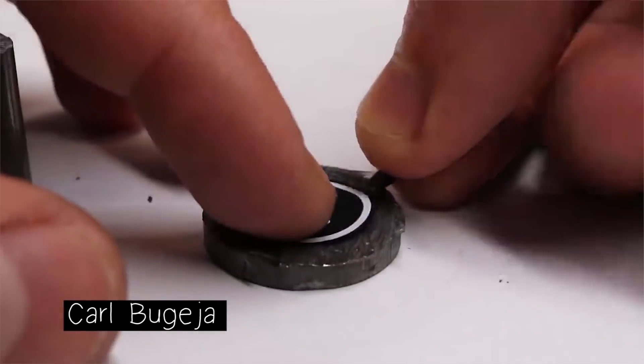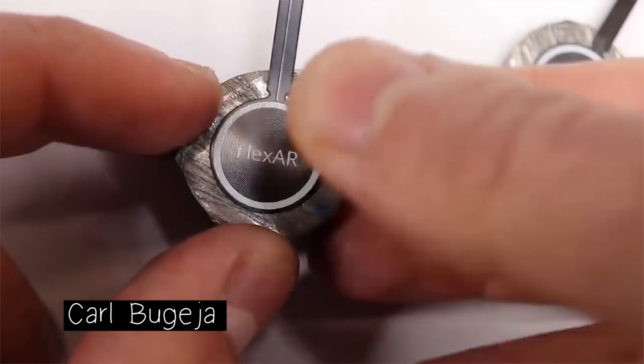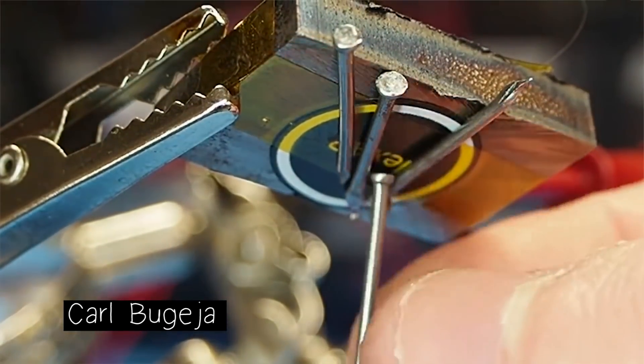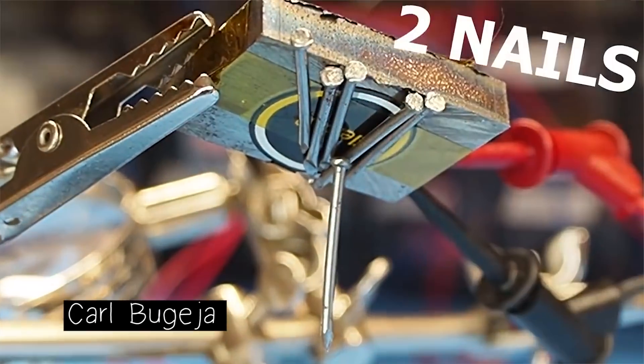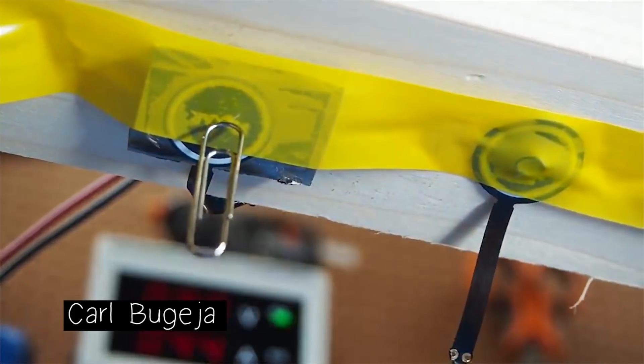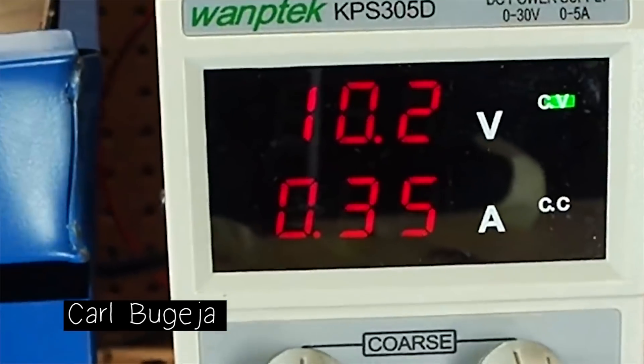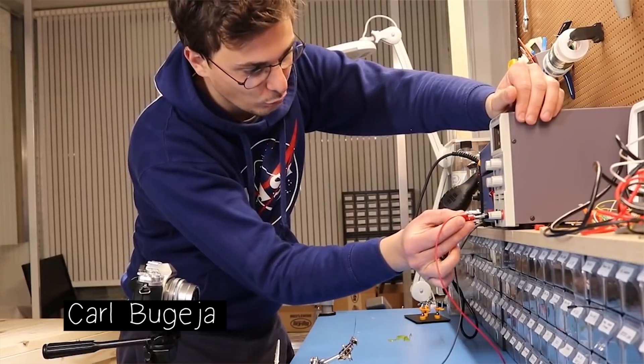What Karl had discovered was that adding iron behind the electromagnet was a good trade-off for his design. It meant he didn't have to waste any coil turns to fit an iron core in the middle, but it still gave an increase in the magnetic field, and as a bonus it even acts as a heatsink — which allows him to overdrive the coils without accidentally starting a fire.